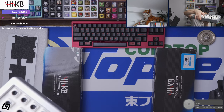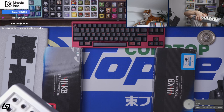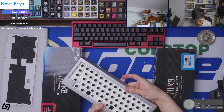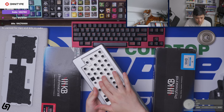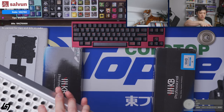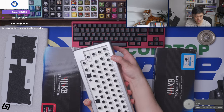In my case, I like to just elevate it a little bit so that I can actually see what I'm doing, where the things are going, and carefully align to the center of that. So one evident thing is going to be that all your sliders come up. And the next thing that I usually like doing is to test them. But in order to test them, you do need to tighten some of the screws so that the PCB actually stays close to the plate.